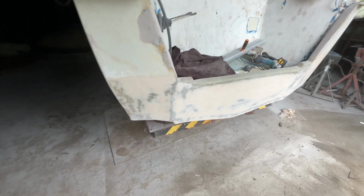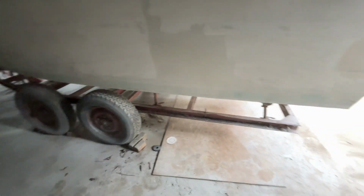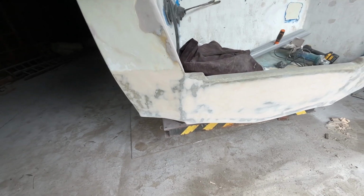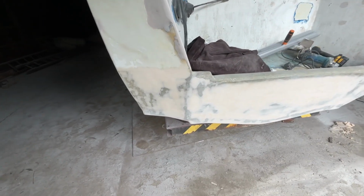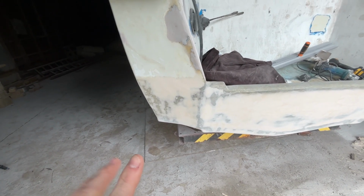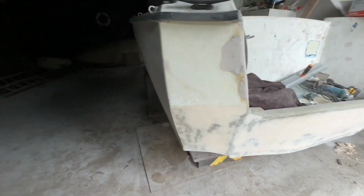Okay, new day. It is going to be a short one today. Main focus is get all the pinholes there and the six underneath. And then what I'm going to do is try and make little tiny batches, with a bit more hardener so it cures a bit quicker. Like we've seen, it does cure in about half an hour anyway, fully. Because what I'm hoping is I can get it on there now, sand it down, and that'll be all the sanding.